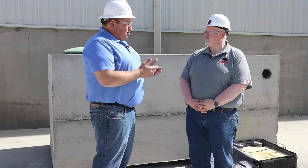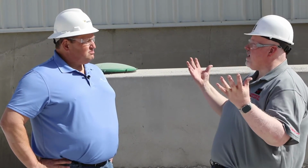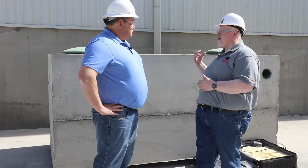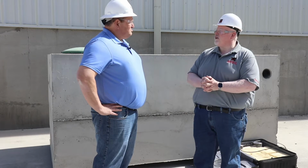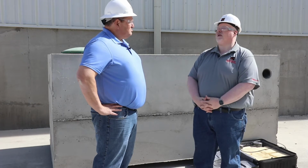Okay, Sam, so can you talk to us a little bit about any precautions we need to take if we ever do this test in cold weather? Well, Claude, you see, the atmosphere contains moisture. So as you're doing a vacuum test with air, as that air passes through, if the temperature is below 32 degrees Fahrenheit, that moisture inside the air will freeze. And inside of the ports for the air compressor, or even the vacuum generator we use, you could have freezing particles that would clog those ports. So we would really recommend that this test not be done in temperatures below freezing.